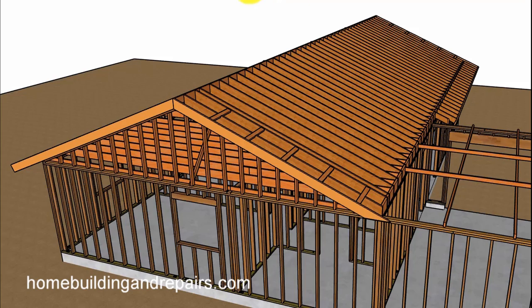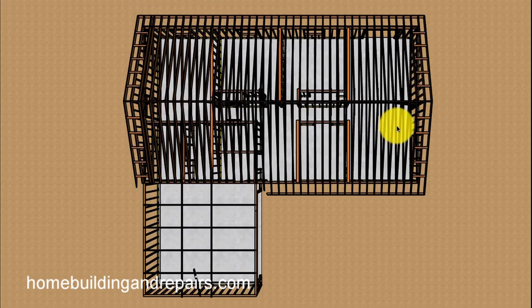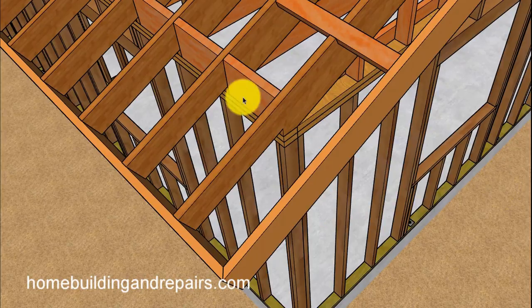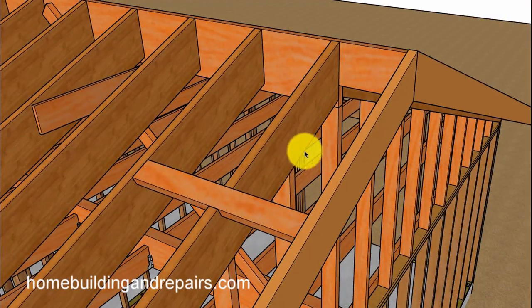Looking at the top view, these rafters are 16 inches on center, two-by-ten. The blocks here are shaped so you can get a nice perimeter nailing. The outlookers for holding up the fascia board are notched into the roof rafter at the end.